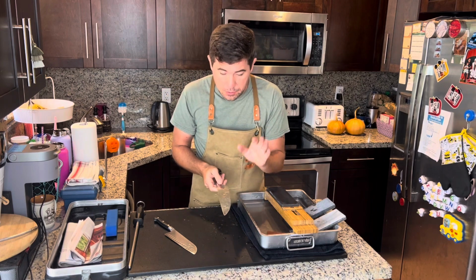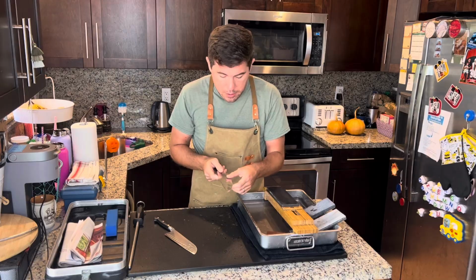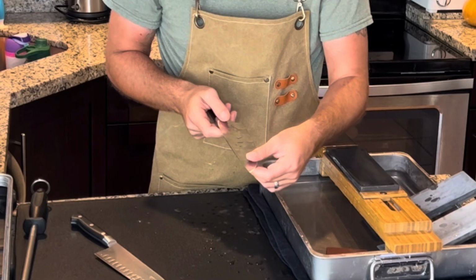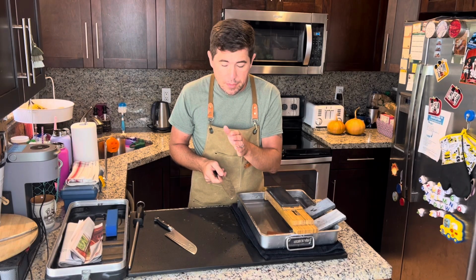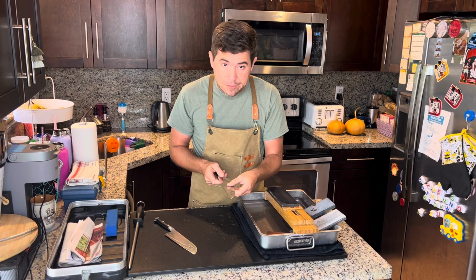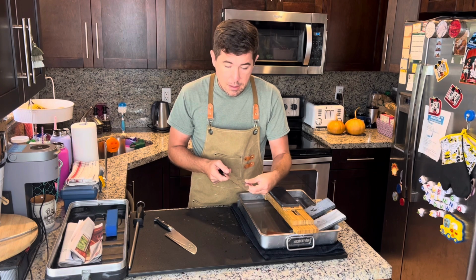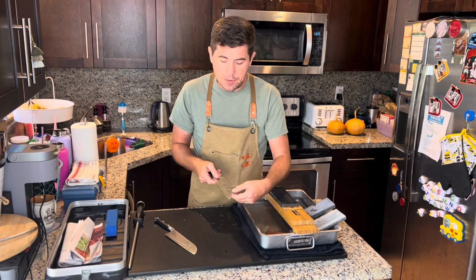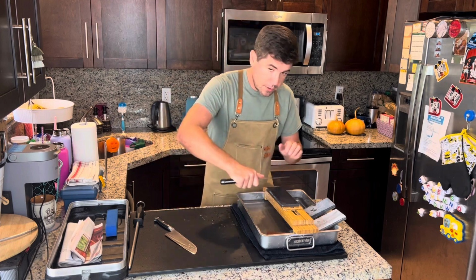And this is where I try to find a burr. And all you need to do, and you'll feel it, all right? You're not going to be able to see it. It's very small. But you just run your thumb on the side of it, and you're going to feel a weirdness scrape across the grooves of your fingerprints. It's there, but I still need to work the front, all right? I feel it in the back, but I don't feel it in the front, so I'm going to work the front a little bit more.